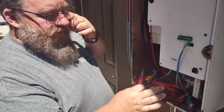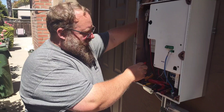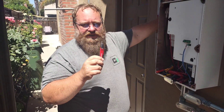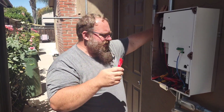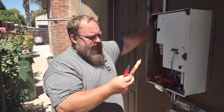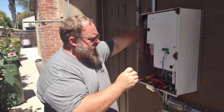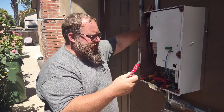I have all kinds of these things and I've had tons of them over the years. I'm not getting paid by these guys to do this, but it's an important thing. Now remember, we're going to test — make sure it's working, come over to our dead wire and make sure it's not working, then go back to make sure it's still working. That's really important to test these. This is a tool that's invaluable. Buy a good quality one. Milwaukee is a great one; Ideal would be my second favorite — you find those at Lowe's. I'm against the Klein ones. I've had problems with them malfunctioning, and the biggest problem is that if you hold down the button, it does not function. If I hold down the button on my Milwaukee, it still works.